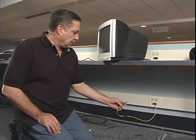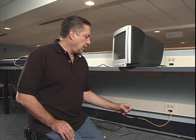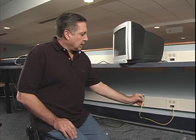Look at this — we came back from the TV studio. We put our light on at the other end, and we know we have good continuity from end-to-end, from the TV studio all the way here to the auditorium in the high school. And that's ultimately what we came here for, just to get a fiber from end-to-end. As you can see the light flashing there, we know we have that good continuity, because that is the light actually coming from the other building across the street.